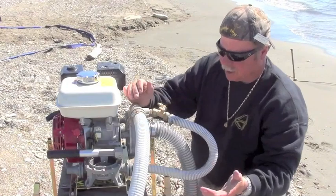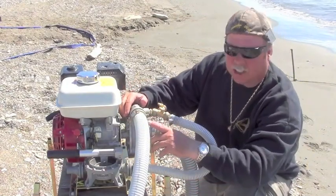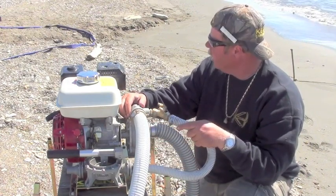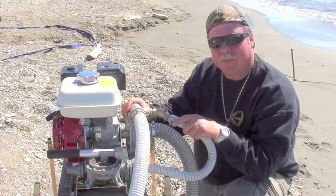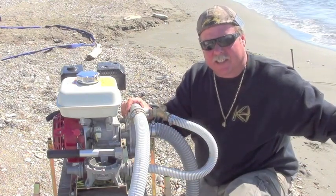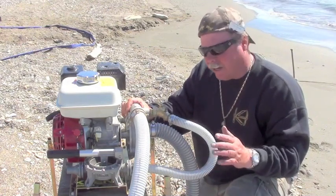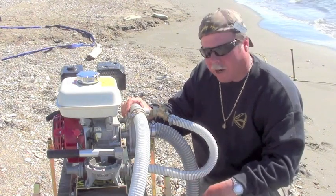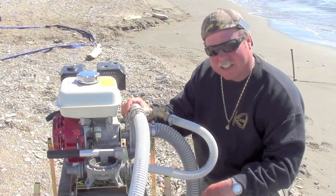Okay, I think the pump is primed. I see that the water has completely filled the cavity, and I'm starting to see water flow down the discharge. Now, I think we're ready to go. This machine comes with a 50-foot line of 1.5-inch nylon braid hose. It comes with a 25-foot long intake that's down into the water. I've learned a lot of neat little tricks being out here. And you know what? We're constantly in a learning process trying to build you a better product. Okay, let's get this engine started, and let's get some water flowing.